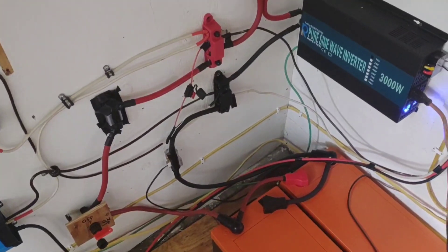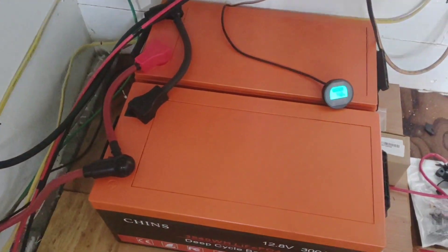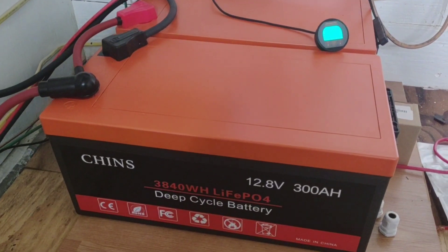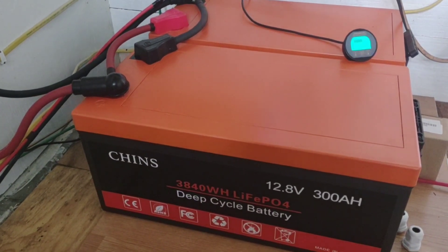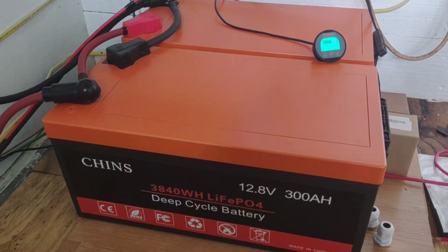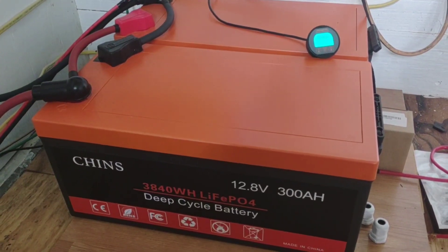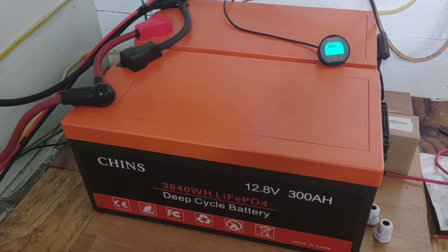For nine months now, running 24/7, the batteries — I've never even put a serious workout on these. I'm running a 20 cubic foot refrigerator 24/7, plus the entire rest of the household, but that's the biggest 24-hour draw. I'm barely even touching this bank. On a 600 amp hour bank, I draw it down in full use from 100% about 16% — that's all it takes before I start recharging the next day. So I'm only cycling about the top 16 to 20%. You just can't beat that.